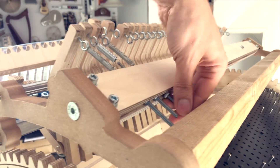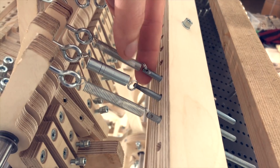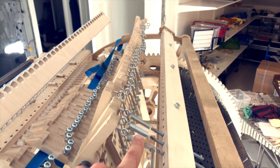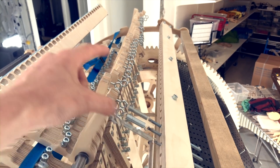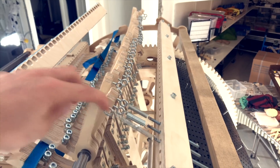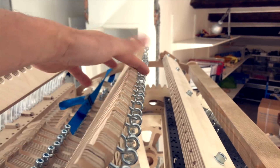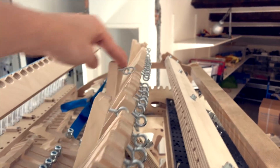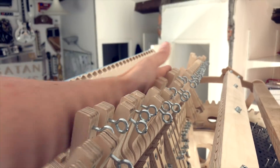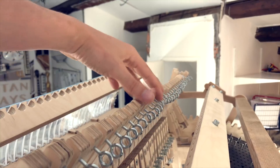I think this design is actually one of the simpler solutions imaginable. The threaded rods can't rotate by themselves because they're retained in this groove. We don't have the real springs yet, so this is just a test with some springs I had lying around - we've ordered them but they haven't arrived yet. Imagine when this is playing music - there's gonna be so many cool angles to film where all these 38 channels line up like this and you will see the melodies.